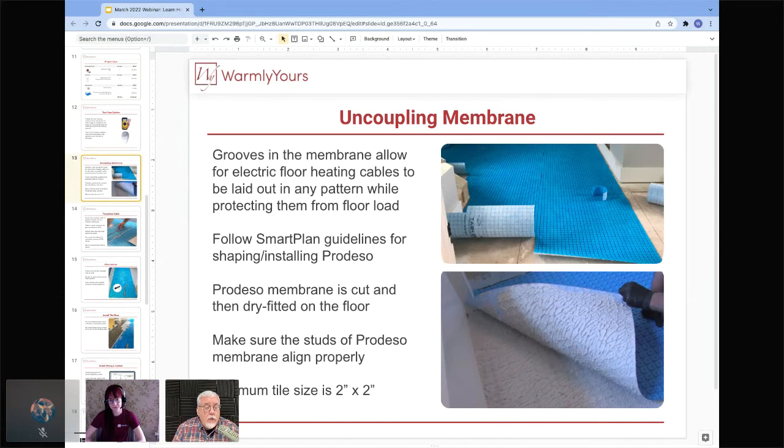So we have ways of doing waterproofing, and you can see right here, if you have two pieces adjacent to each other, what you do is you run the cable back and forth, and then if you need to make it waterproof, we have the waterproof bands that would go over the seams, and then the waterproof bands that go over where it meets the wall. Then we would have the waterproof membranes to do pre-formed corners. This is an external corner, so we have those pre-made also, and then internal corners, which is a corner right here, if you see that.